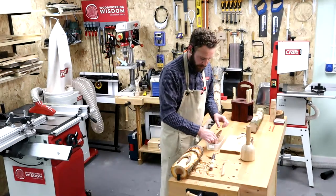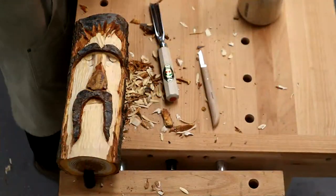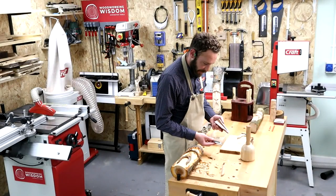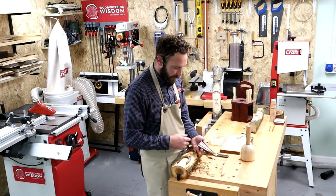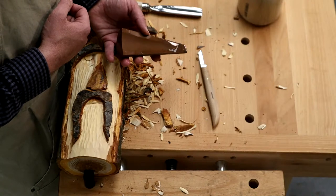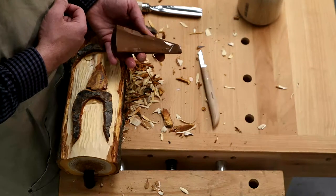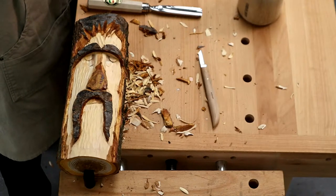It at home, I haven't really got that luxury. I haven't got a Tormek at home. So we can use whetstones. So things like these gouges with the deep sweep on them, you can get these kind of profiled honing water stones. They're usually quite high grit, so they're more your finishing tool, honing type of stone. So these are for keeping sharp.